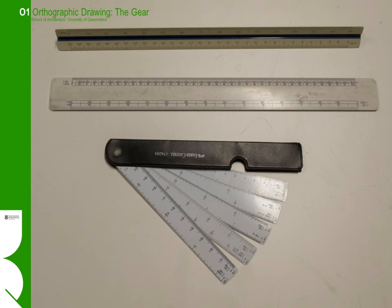Scale rulers are going to be your best friend for technical drawing and also for freehand drawing to scale. They're important when checking drawings, measuring off drawings, and more importantly to design — so the scale ruler is primarily a design tool more than a measuring tool per se. There are different types: the triangular type with a different scale on each side, and the flatter oval-shaped scale ruler which tends to have two scales on each edge, giving you six to eight scales on one ruler. You can also get specialist scale rulers that nest away, but they're a little more unusual.